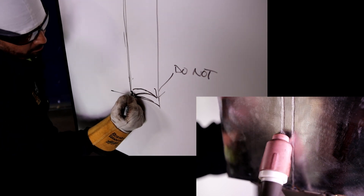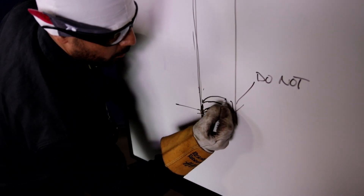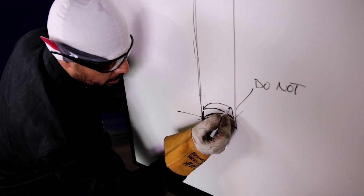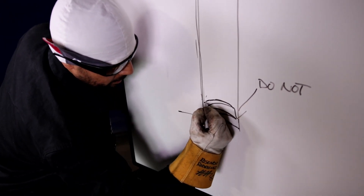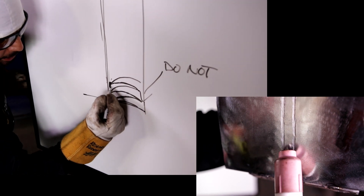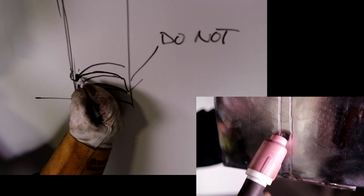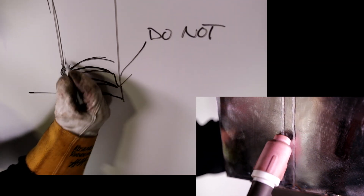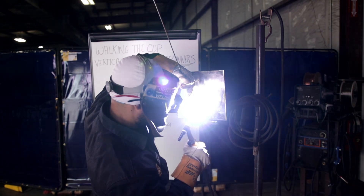What I want you to do is match this line right here. As soon as you match it, you're going to start rolling back the other way. Don't look at this side — keep looking at this side. Roll back again this way. I see it coming, so I slow down, boom, I match it, then I go back the other way. When you stop here, the puddle is following you and it's going to wrap around right here — it's going to wrap around your bevel and keep following you. This is why I want you to stop about 1/32 before your bevel.